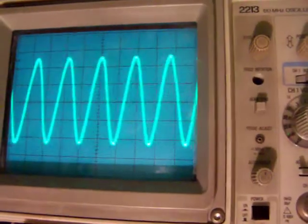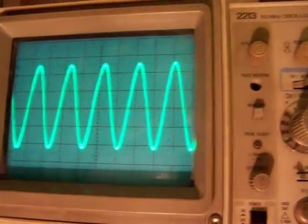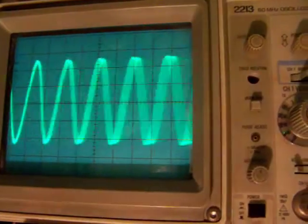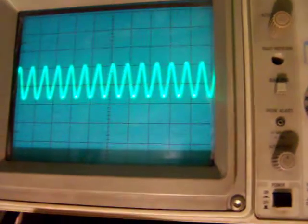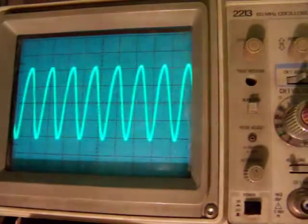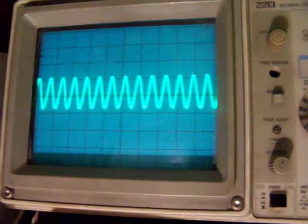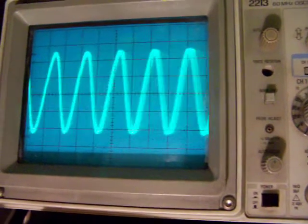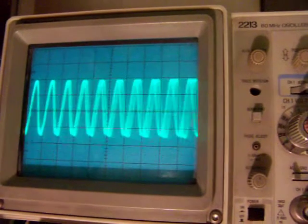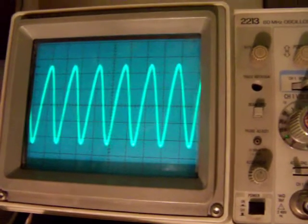But of course, some mixer circuits are not very critical, and they can operate with, let's say, 20% of tolerance. But this amplitude is quite good, I think, though on higher frequencies it goes down too much. But of course, you can make two local oscillators or three to cover the whole frequency band between 4 and 12 megahertz. And of course, there are all kinds of complicated circuits to keep the amplitude perfectly constant, but that's not my aim. I always want to keep it simple.